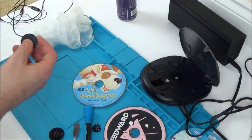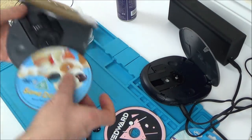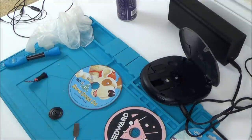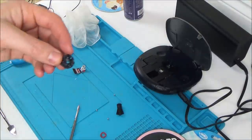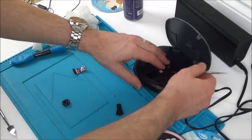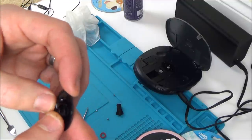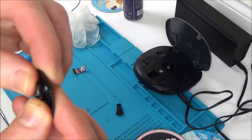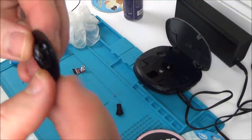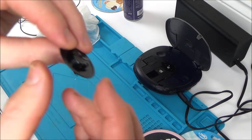At least I haven't broken that one — it will still work fine on the other unit. I'm going to look around the house for any other spindles that might fit. Not having much luck. I don't actually need it to be a pressure fit — this can be glued down onto the motor. I'm wondering whether there's a way I can just make this work by gluing it down, because the one I took off before was glued down anyway. I just have to make sure it hasn't spread out too much so it can grab discs without snapping them.